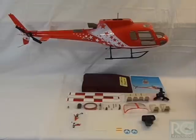It uses your standard equipment: a 6S battery, 1800 to 2000 kV motor, 9 to 15 gram micro servos, and a flybarless gyro system. It's 35.5 inches long by 11.5 inches high by 6 inches wide. So let's get into the build video.